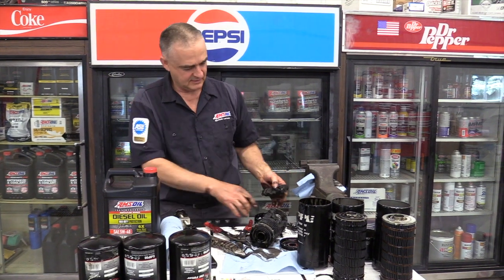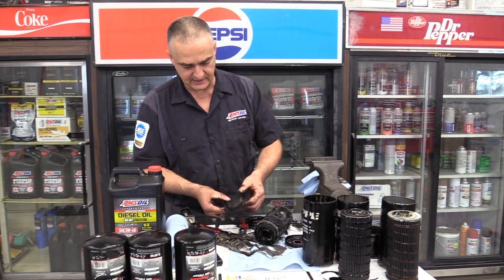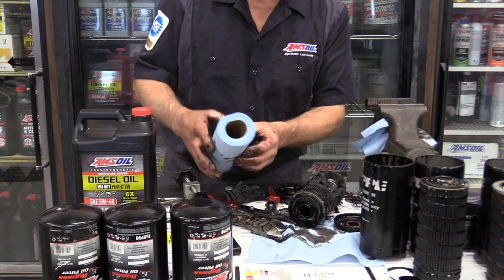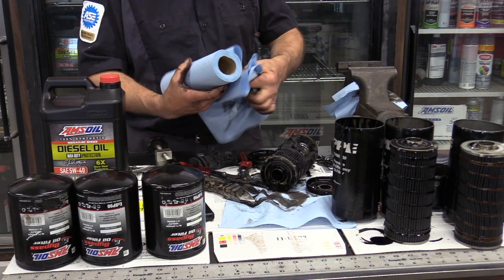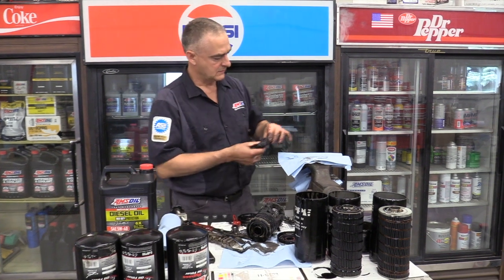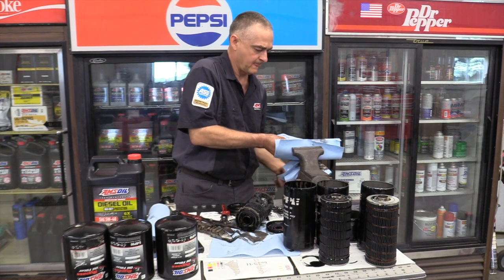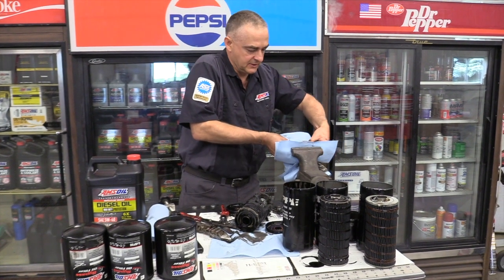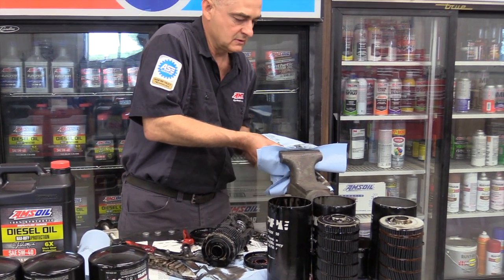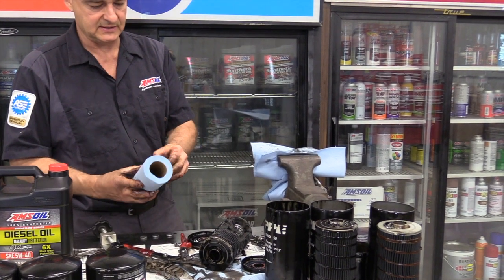Things are getting slippery. I've got a piece of that media — again it's got a screen backing on it because it's synthetic media, and that's what supports the filter media. I'm going to put it in the vise and squeeze it as tight as I can. What that does is squeeze out the residual oil so you can see what's in that media better — otherwise the oil masks the dirt or the metal. Just squeeze and squeeze as tight as I can to soak out any oil.